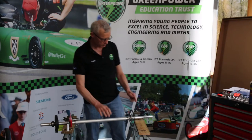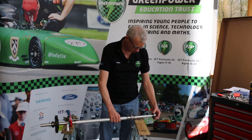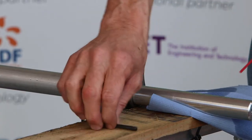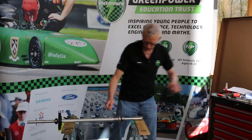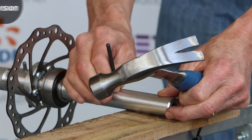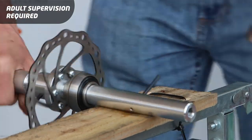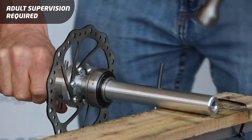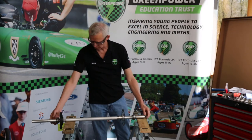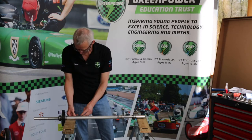That's our brake disc on there. The next step is to get our rear axle bearing and put that on to the axle, because we've got yet another pin to insert. As before, a bit of oil to lubricate the pin and the hole, not forgetting the safety goggles, and then we're going to get noisy again. There we go — that's about right. So now our bearing can't come off either. You will notice that because these screws weren't tightened they've come loose — I'm just going to tighten them back in gently.